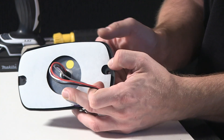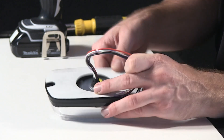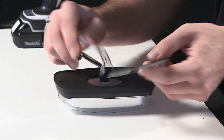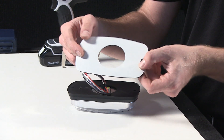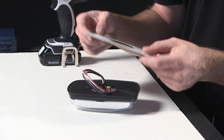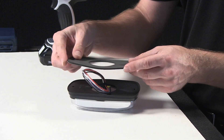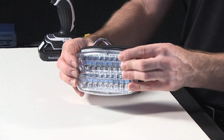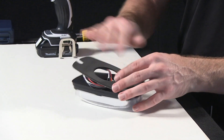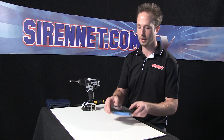To start things off, I'm going to remove the back covers. This one here happens to be foamed on one side, adhesived on the other. For your install, you'll actually flip this over and put it onto the gasket backing. The foam will then tuck against your body panel to help seal the back of the unit, basically keeping grit and grime from getting onto the nice paint or polish behind this light head.